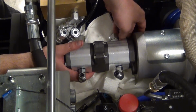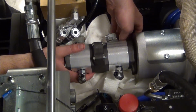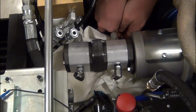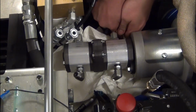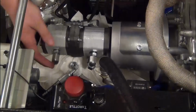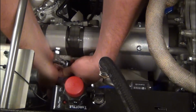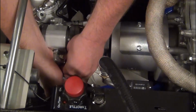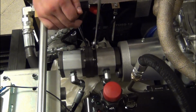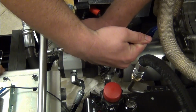Tighten the 2 bolts that hold the pump in place. Make sure you also use the 2 flat washers and 2 lock washers. Be careful to put the bolt through the gasket so that it holds the gasket in place. Orient the fittings as they were with the old pump, and then attach the hoses to the pump. Tighten the hoses. Tighten the nuts against the pump housing.